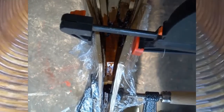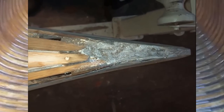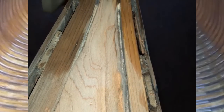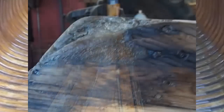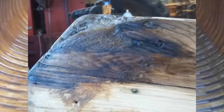You can see the shingles and saran wrap used as a release agent. Then I put reinforcing pieces in behind and built a new stem out of sawdust and West System epoxy. After a couple of applications, it's cleaned up a little bit. Here's another application, and you can see everything's starting to fill out — it's coming back to shape. Getting some real strength here again, but this whole corner on one side is still gone.